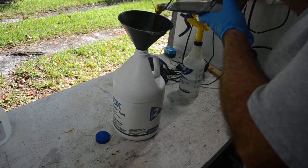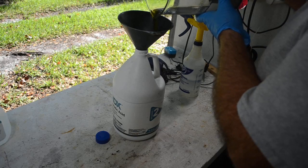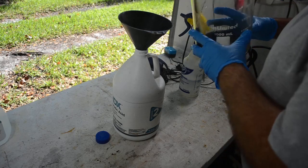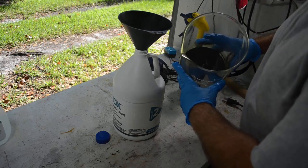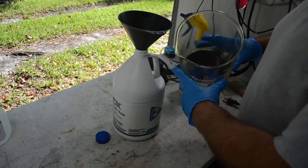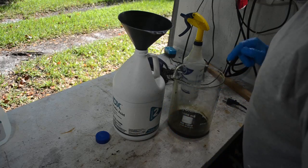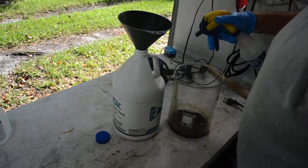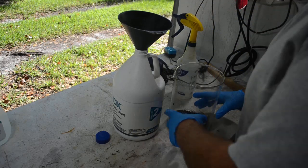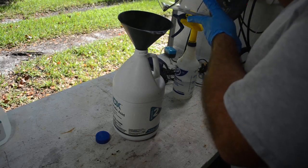So temporarily I can store this liquid in these until I can process it through my waste processing system. And I think in the last video, that looks pretty good. There's not a lot of steel filing stuck to the magnetic stir bar, so that's a good sign. I think we are really ready to go on to a nitric acid boil for this stuff, because that looks really good. Yeah. We have gotten, if not 100%, then probably 99.9% of the steel out of there. The nitric acid will take care of any that's left.